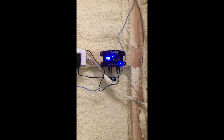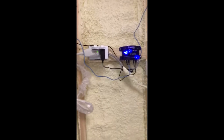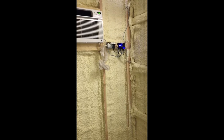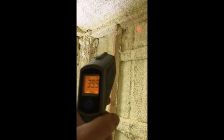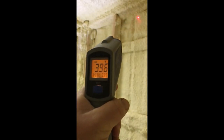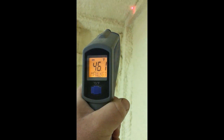We started at 62 degrees and now, about 10 minutes later, this 8x8 walk-in cooler is at 42 — dropped 20 degrees in about 10 minutes. It's awesome. We've got the temperature reading up here near the roof at 40 degrees, but that's right in front of the blow of the AC unit so that's not really true air temperature.